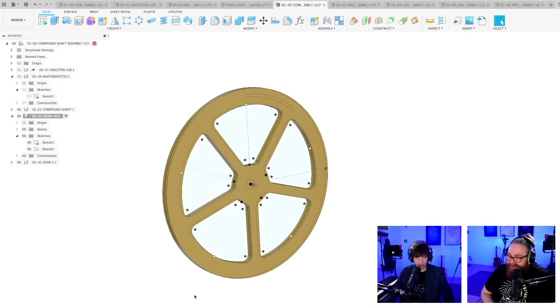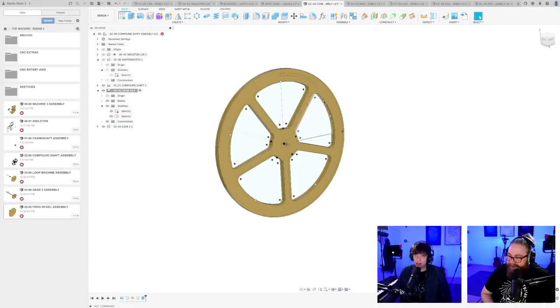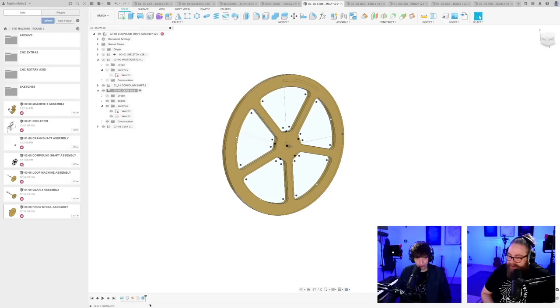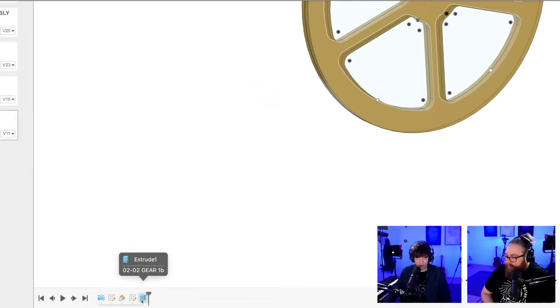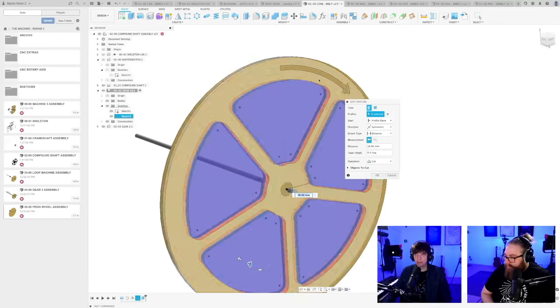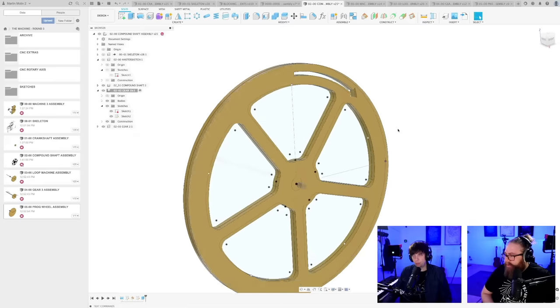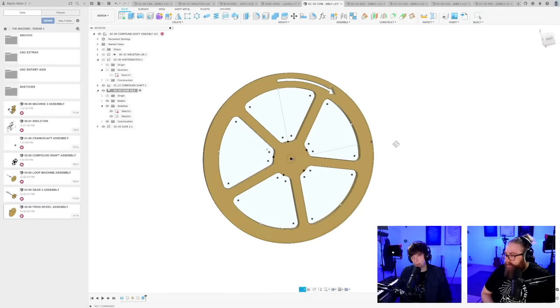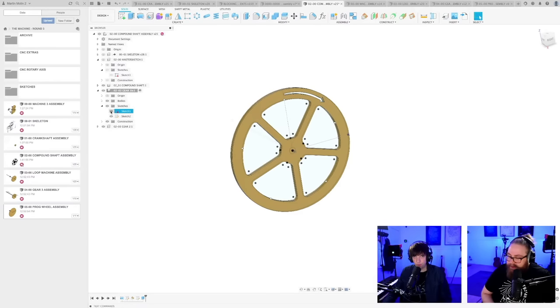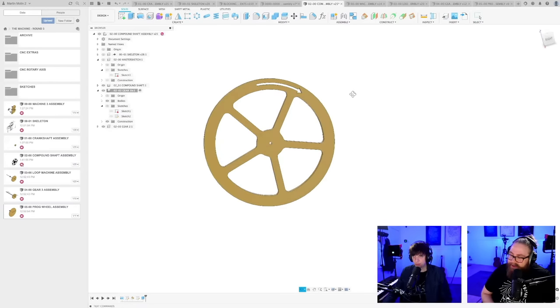And then another beginner thing. Let me show you the timeline. Now you think, I already cut this, so let me cut out the arrow and make another cut operation. No. Go down to your timeline and redo the cut operation you already did, but just include the arrow this time. Oh. That way, you have a cleaner timeline. There we go. We all strive for that clean timeline.